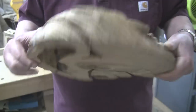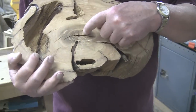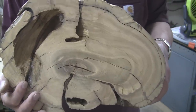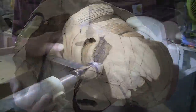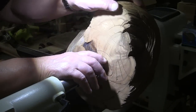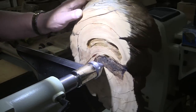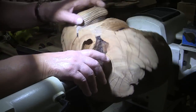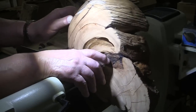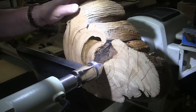So this is what we have. Here's the bottom — I'm going to put a tenon on there. I've marked a spot here for the center, and I'm going to drill a hole for my woodworm screw. I've marked two circles for a tenon: the inner one is for my smaller tenon, but because that's made up mostly of bark inclusion, I went ahead and marked a larger one for my larger jaws. It still includes the bark inclusion but includes more solid wood around it.